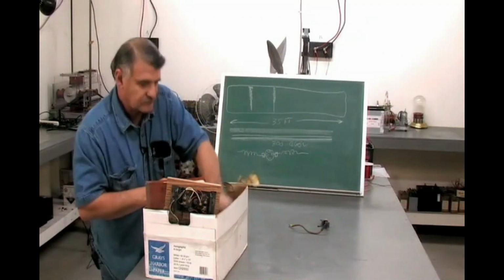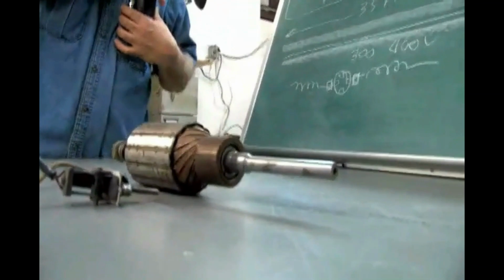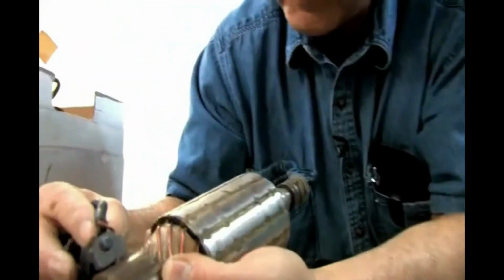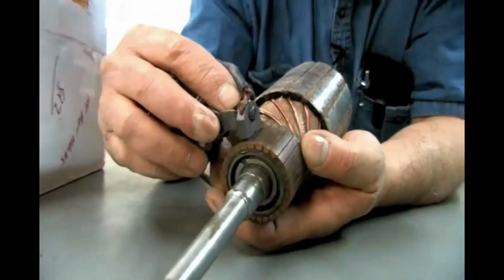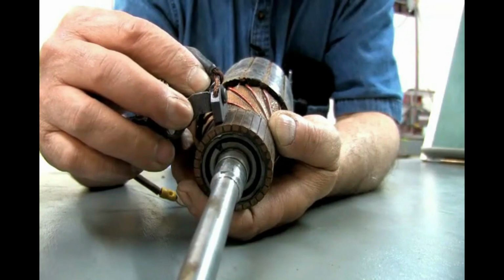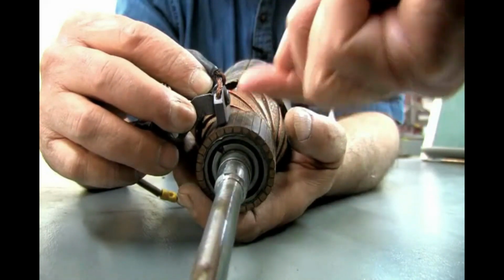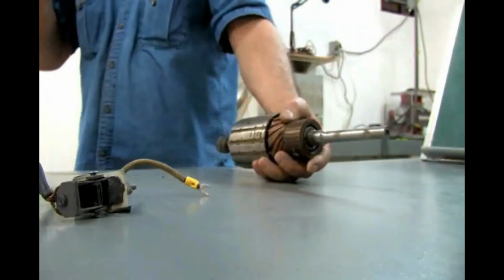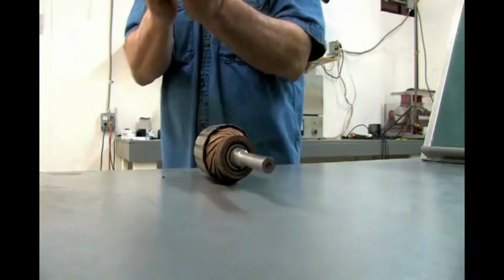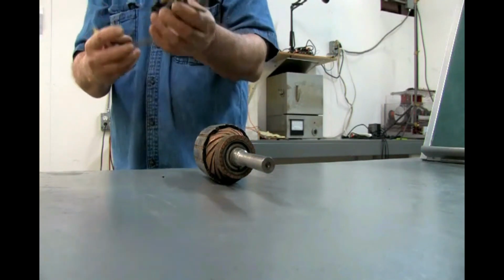See, that's a good question, because if you look, let me get my glasses here. If you look very carefully, this brush just fits. It fits between the slot. But the other brush would have been partway across this, shorting these poles out. But the new brush would have been the same width, surely. No, the new brush was much thicker. These are sanded. They were sanded to a thinness. Okay, so the width of the brush was right. Lockridge sanded that down to fit.